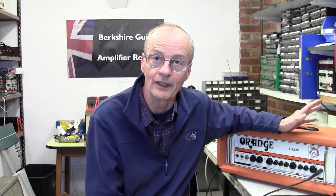So this will either be something fairly straightforward or it could be a bit of a pig to repair. When you're repairing an amp you should have a theory in mind and I've got one or two ideas. It could be a power supply problem - basically the power supply to some chips inside just disappearing. I haven't checked if it's got an FX send and return jack on the back - that will be my first port of call. Let's just see if I can get it to perform for you.